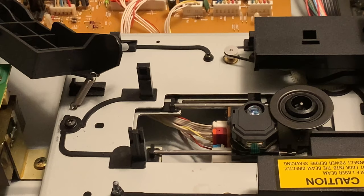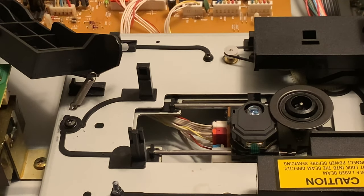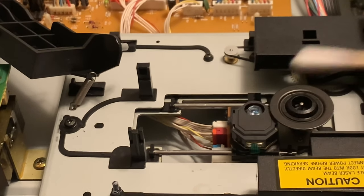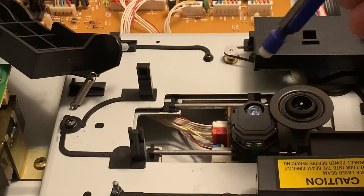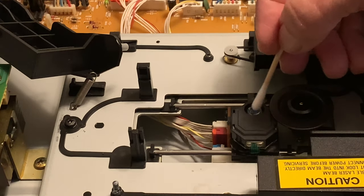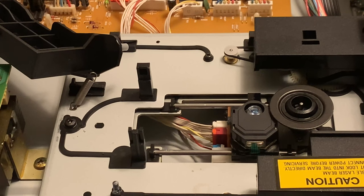When I opened it up, I was looking at two things. First, I wanted to clean that lens — that photocell. So I used a Q-tip, which I had in stock because I do a lot of cleaning on my cassette decks as well. One interesting YouTube video showed somebody actually using a pencil eraser, but to me that didn't seem to make too much sense — I was worried about residue or damage. So I just used a Q-tip, went in carefully, cleaned it, taking my time. I didn't use any solution or anything like that.